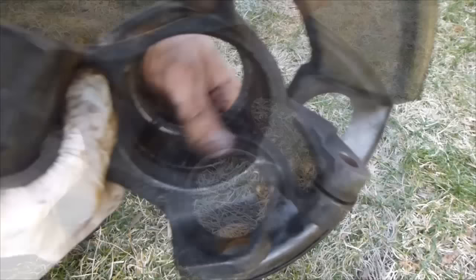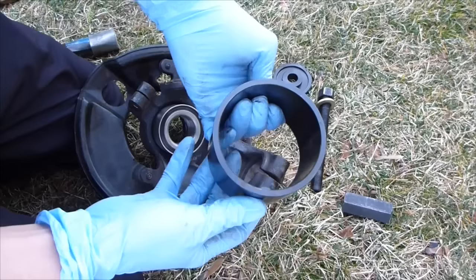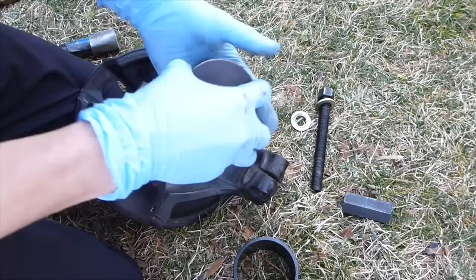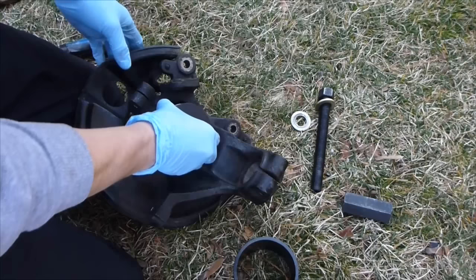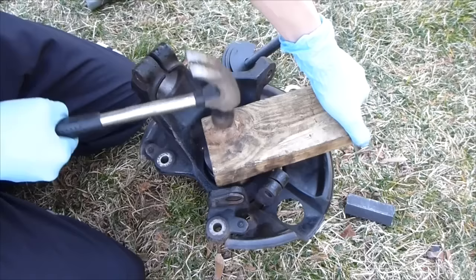The bearing has been completely pressed out. I'm going to add some new grease — not a lot, just enough to help the new bearing slide in. Just a little bit, not a lot. This side fits in better. With the bearing press kit, you can see this fits perfectly on the bearing — it sits on the outside edge so that when it presses, it presses on the whole bearing so you don't crimp anything. That's what you want to make sure you have.